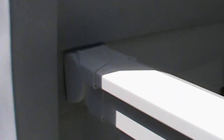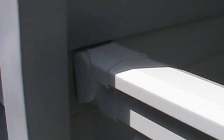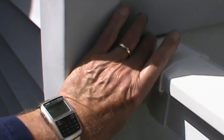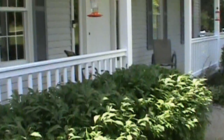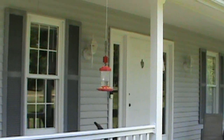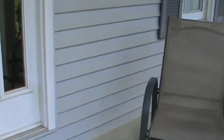Also, we patched the vinyl — that turned out well from taking out the old rotted wood and old spindles. And these stair brackets worked out great in that the angle lets them tilt back to follow the angle of the vinyl. That worked really well. So everything turned out great. Let's come up here and have a look both directions.